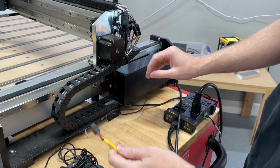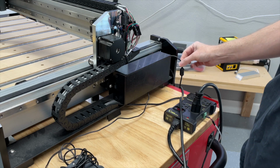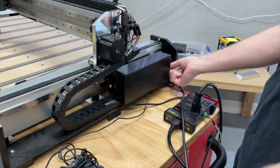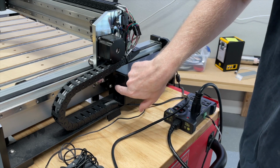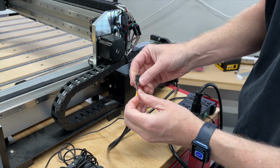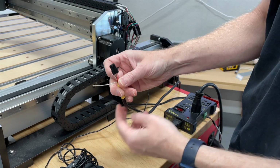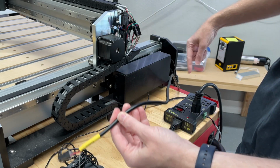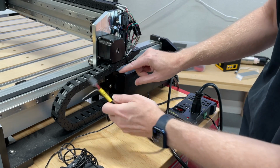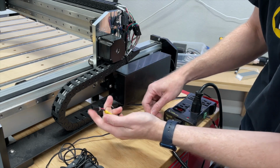Okay, over here on the right side of the machine, we'll find the Shapeoko's controller. This is the actual controller. There's a USB cable going to a computer. The power cable, yeah, those are flipped. That's the power cable. That's the USB cable. But up here in the front, there's a little Molex connector that's sticking out from the metal. This is where we're going to plug our connector, and here's our shield drain. So any electrical interference that's received by this cable will drain through this little plug right here. You can simply screw that around. This little screw up here on top is what I typically do.